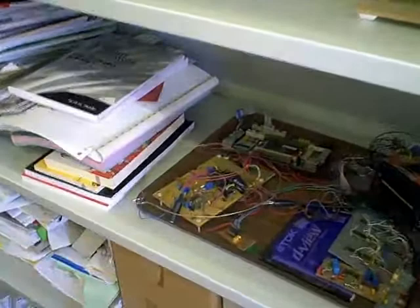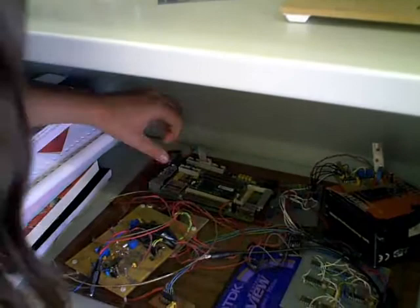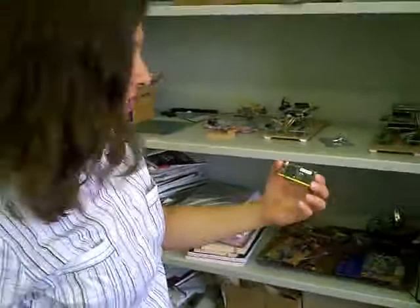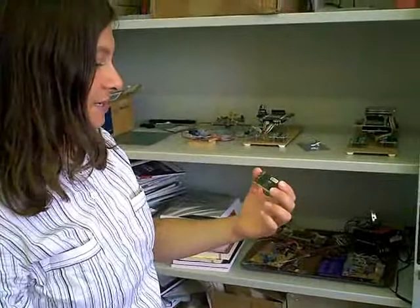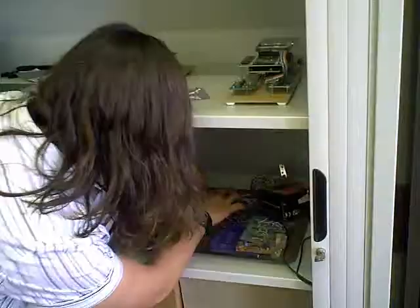This down here is version 1 — the original version of the RFID Guardian. We actually started by using some commercial off-the-shelf hardware from another company. This was a development kit from a company called Strategic Test. It had a platform with a single board computer module — a PXA270 X-Scale processor. This was the very first board we used for our RFID Guardian experiments. We eventually decided to migrate away from it because it was a closed platform and also commercially very expensive.